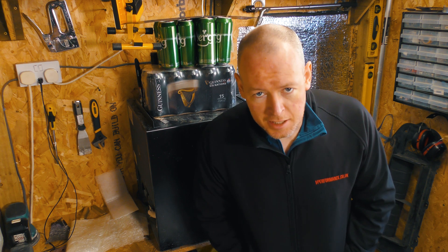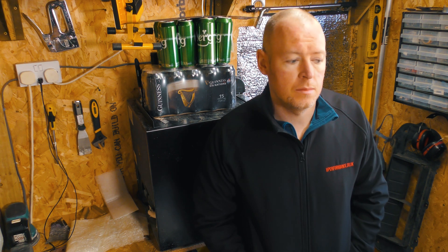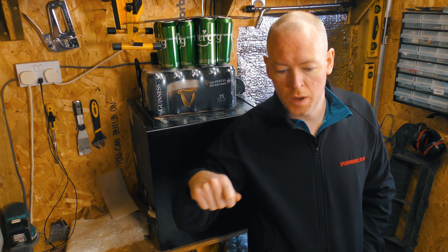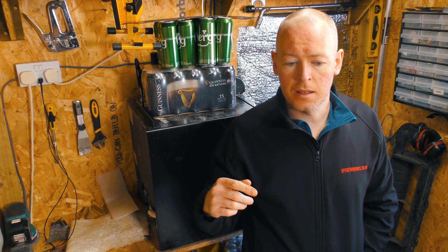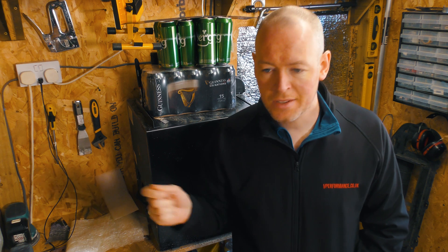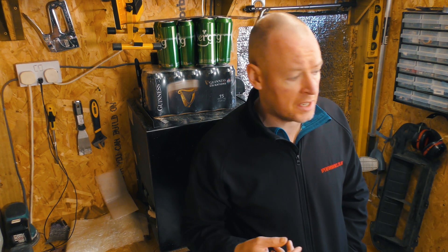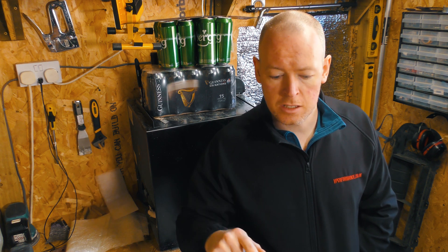That is a horrendous dusty mess, but at least I now have a plug that I can work with. It's going to need some more layers of epoxy. I'm going to have to research a way of filling in those gaps, because I can't mould over that and I can't just use body filler — it's all polyester and it'll melt the styrofoam or styrene or whatever we're calling it. I'll find a solution to that and come back in the next video.